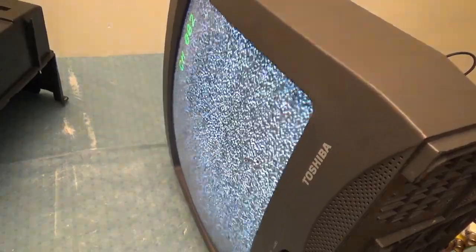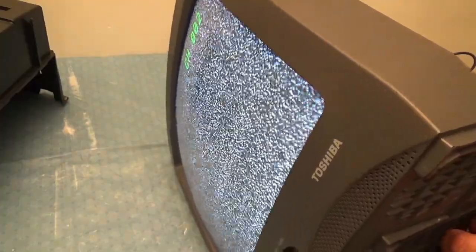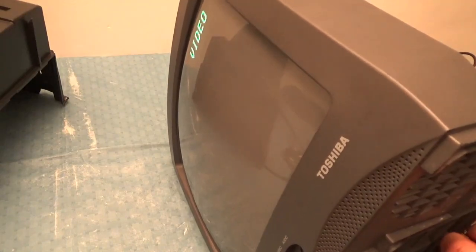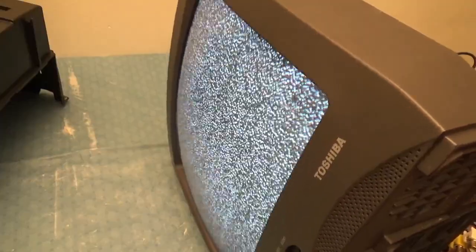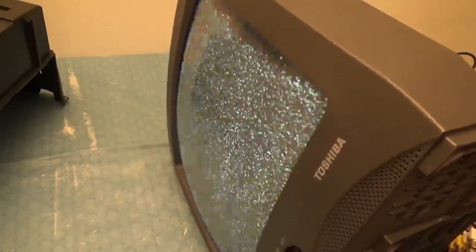The TV is on its side. Let me figure out which button is going to send me back to video — let's leave it at the static screen. So I am licking my finger and touching these pins. Nothing at all — that's making me think this chip I'm touching must be the computer side. I'm going to touch these other chips. I heard the sync frequency mess up a little bit. They went dark for a second. That went dim.